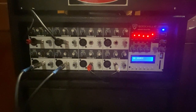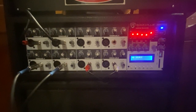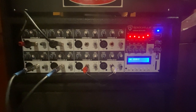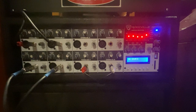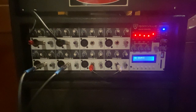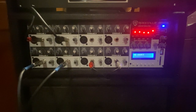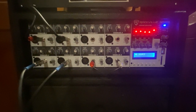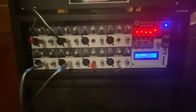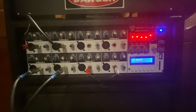There is an effect. I think it's a single quarter-inch jack on the back. I think it's a stereo jack, so you can have an output and an input by using just one single ring tip sleeve jack to an effect of your choosing. I've never personally used something like that. I've only used typical effects loops where you have the preamp out and power amp back in, meaning two cables. I've never had to use a single stereo cable in and out to accomplish the same thing.